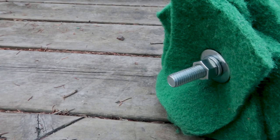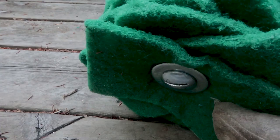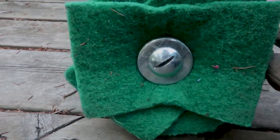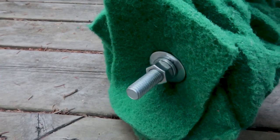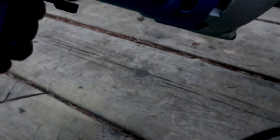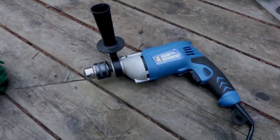This is what the abrasive polishing buff looks like when it's done. There is a lot of squishing or compression between the two sets of washers which clamp the abrasive polishing pads together — it's very tight. Bolts can sometimes bend when spinning, so you need a thick bolt. This needs to be a half-inch bolt so that it won't bend. This drill is a half-inch variable speed hammer drill — that's what I use and it seems to work quite well. I'm sure there are similar models all over the world.